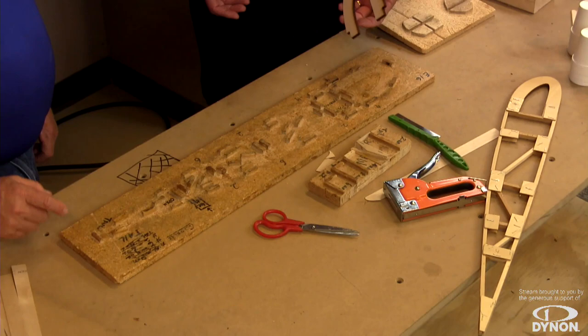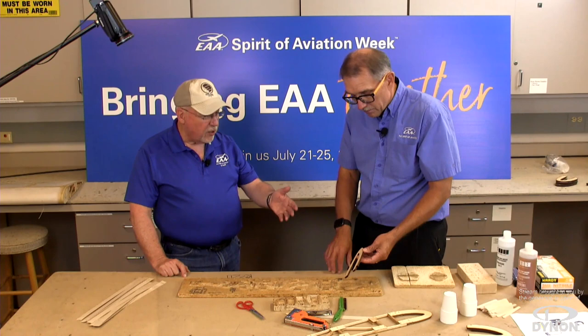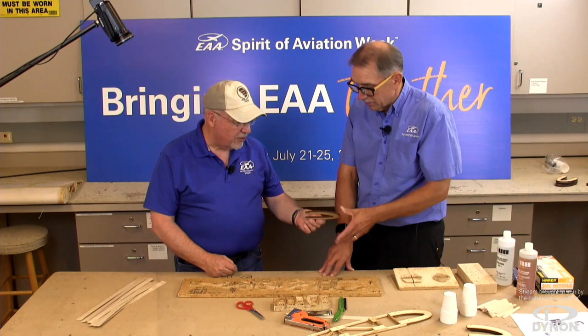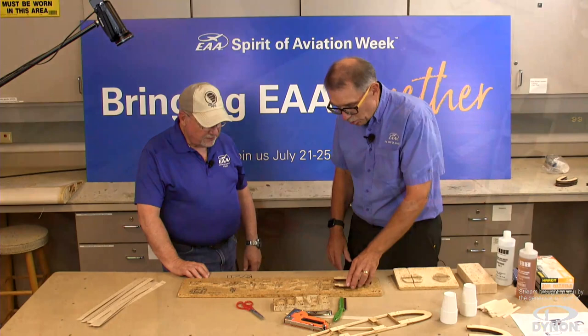So we have our nose piece already cut — these are parts we use in our projects here at EAA. It's a laser-cut part out of plywood. In the current day, if you get a wood aircraft kit they might already have those cut out for you. Or you don't need a laser cutter — you can get a sheet of plywood, make yourself a template, draw them out, and on your band saw cut these out, then use your Dremel tool to clean them up. We place that in the jig and it just snaps in.